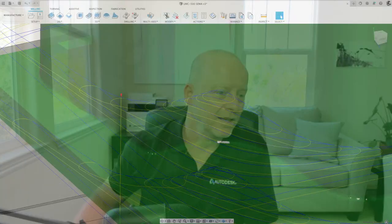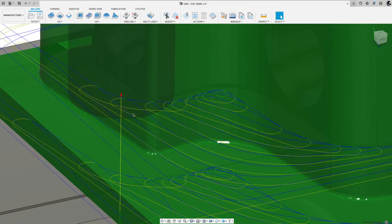If you have a model, a mold the size of, let's say you're machining a massive mold and there's a lot of toolpath and that part is really big, it's going to take a long time to calculate that. So it depends on the model, depends on the size of the part, depends on your machine tool. Machines do run better when you have smoothing on. When it's machining, you'll get a nice smooth toolpath. If you're doing a straight line, straight line, straight line, like a lot of them in succession, you can sometimes get data starvation on the machine or stuttering, and then the motion of the machine kind of chokes on it and it can't keep up with the code. So generally, I'll use smoothing almost all the time. There are exceptions, though. Okay, coming back to this. All right.